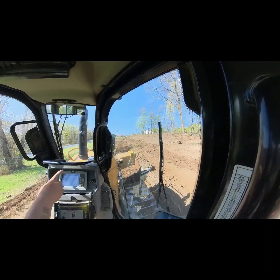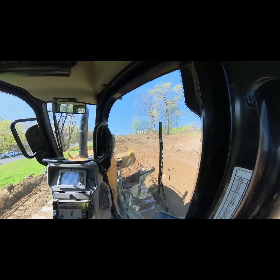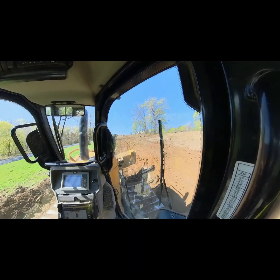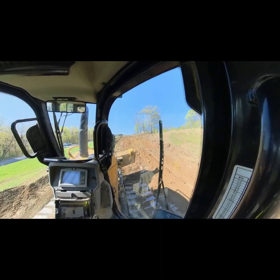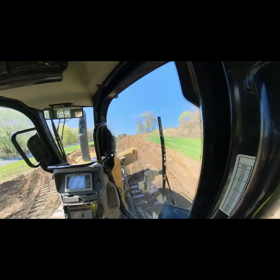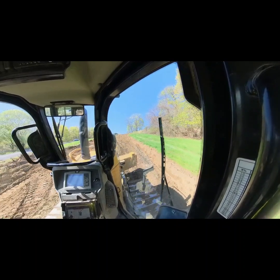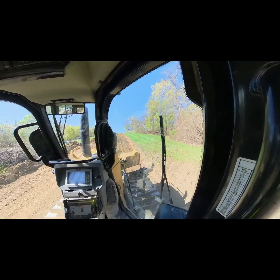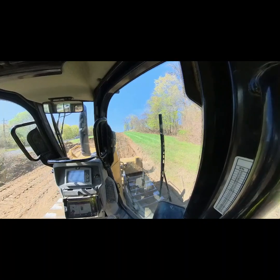Now it was this hill this morning, just a giant hill. What we did was we cut the subgrade so we could run this long, deep sewer run down through here with no issues. And it also makes it so benching and trenching and things are much easier without these side slopes and stuff. So just a tip, keep everything open and wide as you can and make sure everything's benched and sloping correctly. So we're just gonna keep poking away, but you can see we got to the right side by a good 4 foot. We started way down here. We went all the way up to the top there. So we're just gonna poke away at this for the rest of the day and keep filming here and there and keep checking in.